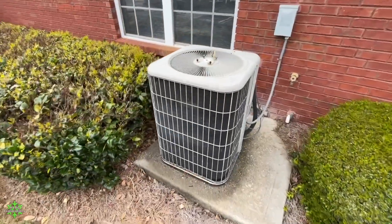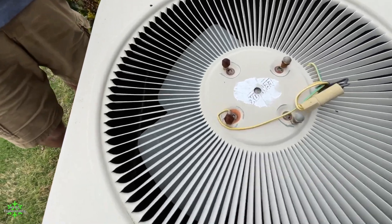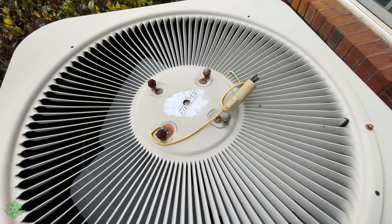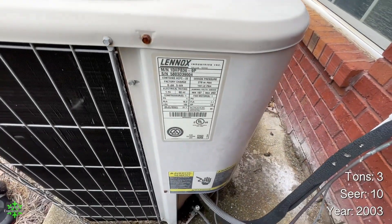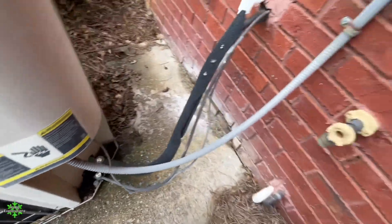Got one right here — it's got an older Merit three-ton, four blade. It's got the double-layer coils. A new motor too. This is a three-ton 2003, 10 SEER. Most of the motors on them have been replaced in here.